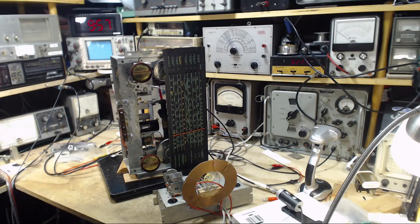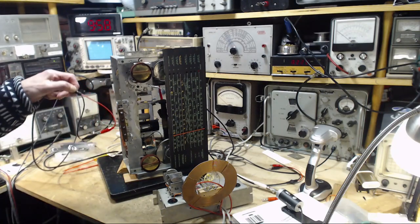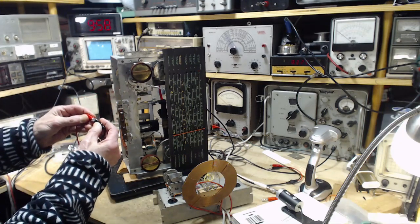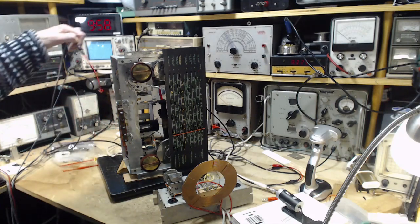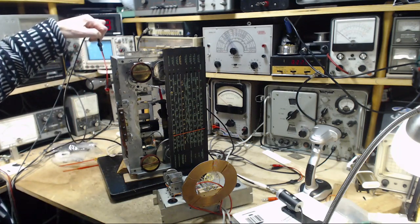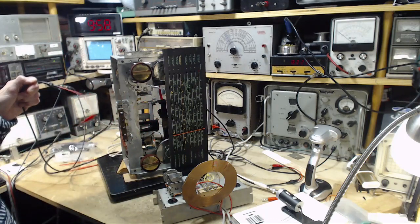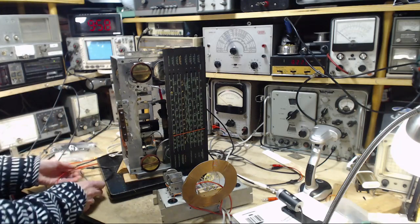So they're gone now, because now I'm going to use this fancy coil here. That's right, I discovered that if I just clip the clip leads together, like that, this is enough of a coil to pick up all the signals I need. What signals am I picking up? I'm picking up the local oscillators, the primary signal. So I can throw this here, I can throw it up around here. So that'll be the pickup coil. The weird thing hanging on the radio is gone. It was of no consequence anyway.